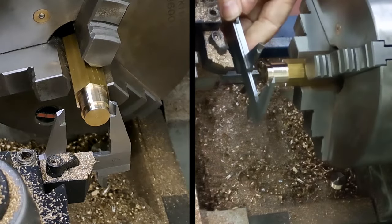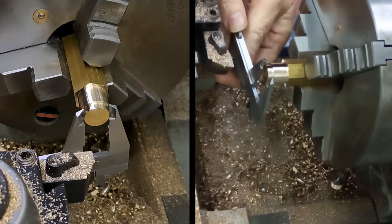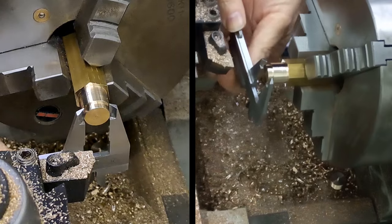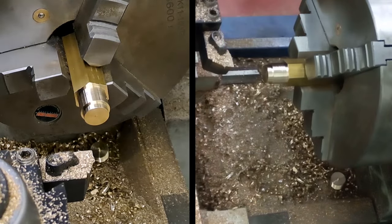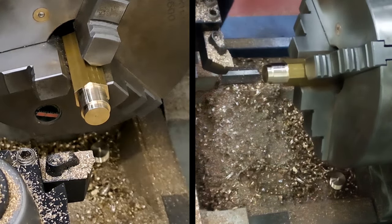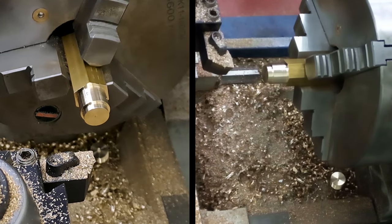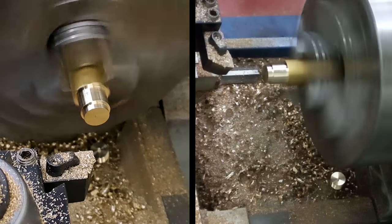Let's see how we're doing. 12.6, 12.7 will be the target values. It's only just to stop it bunging up the end of the pump. So anywhere around there will be close. We're at 14.3. So we've got about 1.5 mil to come off, so we can go 3.7, yeah, about 1.6. So let's take two more cuts, and then we'll check again.